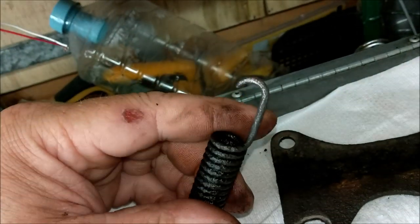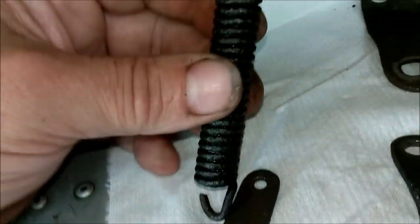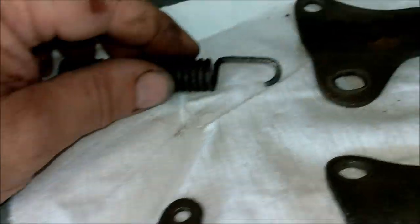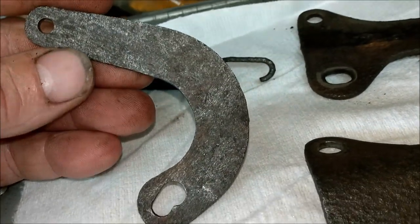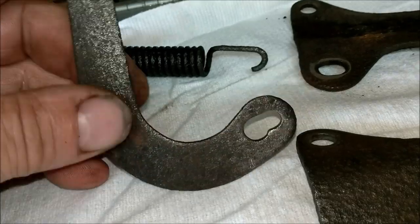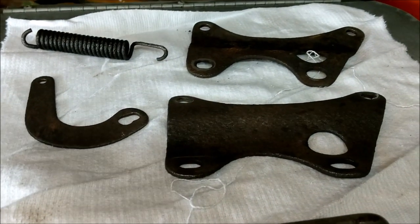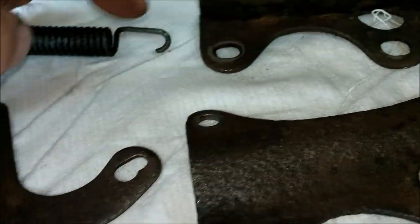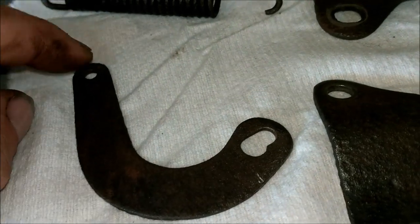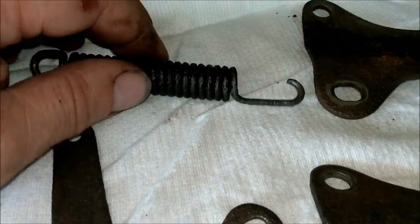It's not brilliant but it was literally just dangling off there. The electric contact - if it was rust between there and there that wouldn't have been getting a proper zap, so perhaps I'll try it again. It's actually a lot better than what it was and it sort of looks like what it should be now. Overall, does the electrolysis work? Yes I think it is. If I'd had better contacts - I literally just wrapped some copper cable twisted around the holes - if I would have actually bolted it I'm sure we'd have had a slightly better result.